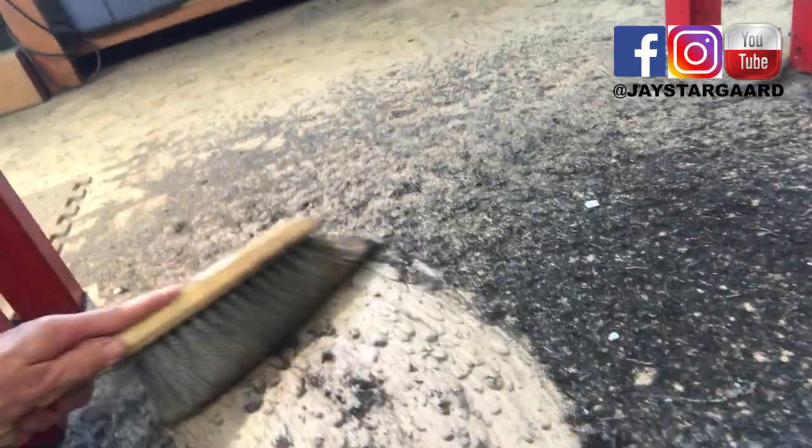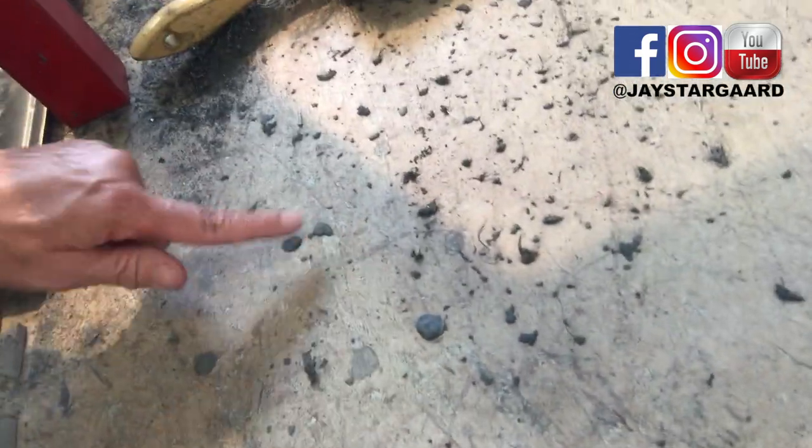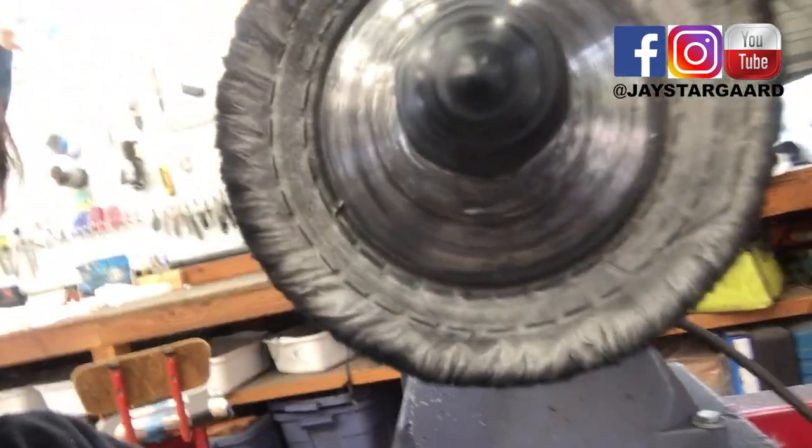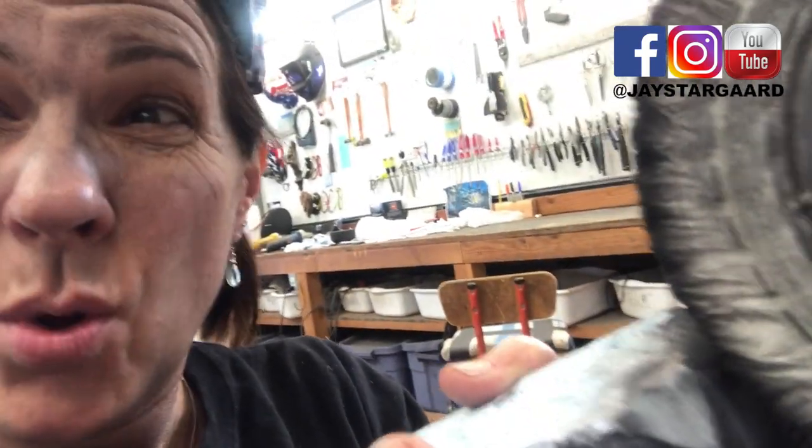Let's take a look at whether I used too much buffing compound or not quite enough — this is how you'll tell. I'm going to sweep away all the dust. I haven't cleaned this up in like five or six days, so it's not bad. You see these hard glops down here? That is an indication that I've used too much buffing compound. When the wheel is on and you hold the compound on too long or press too hard, it causes these drips — that's wasted product.